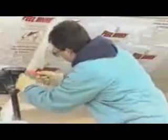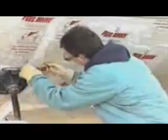After the product is applied to the hull, it is covered by a specially designed peel-away blanket. To apply the blanket, simply hold it up to the hull by two corners, smooth it onto the chemical at the top and out from the center, moving towards the outside edges. This will minimize trapped air bubbles. The blanket increases the efficiency of the product while keeping it contained neatly on the hull.